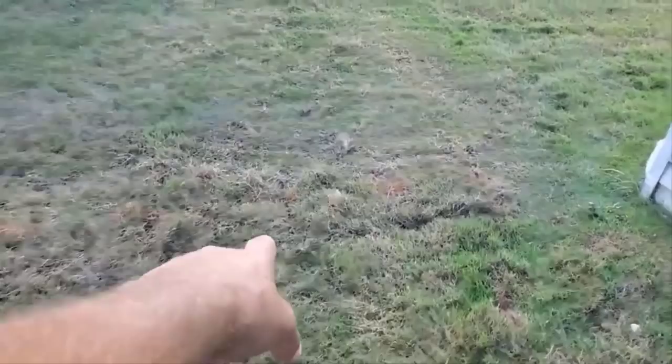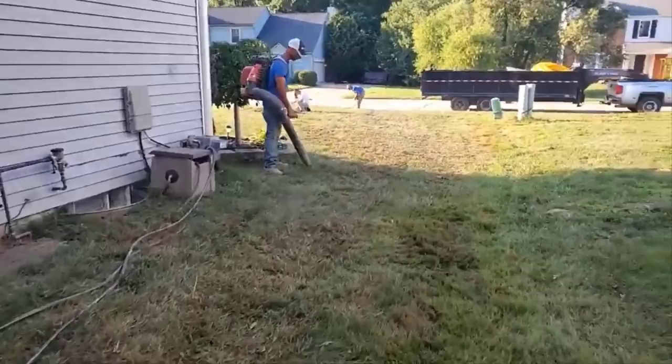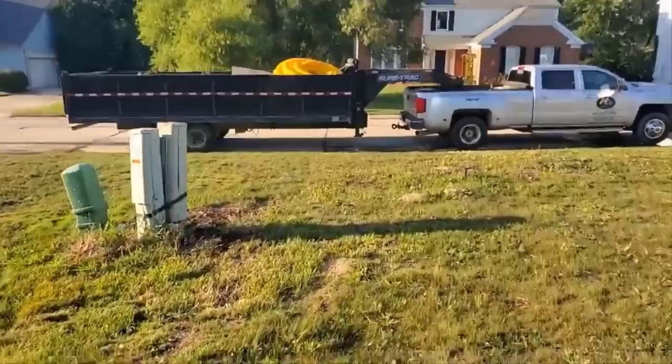So we have two lines of defense. Here's a covered French drain. So one was a fully open French drain. This one was covered to open because there was so much water collecting on the patio that I just wanted to grab up all that water. Both these systems run to a 24 by 24 inch blind inlet. Now this is a finished product. The grass will mend, this will heal. I mean, it'll knit together quickly. This is amazing, the work that these guys do. I mean, it's just unbelievable. It's second to none.